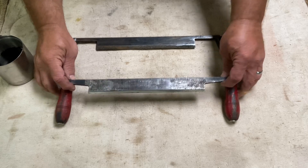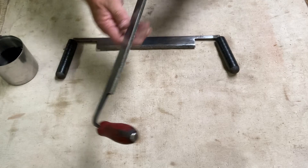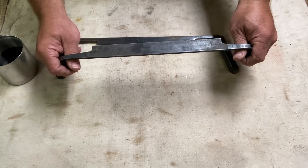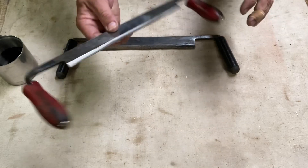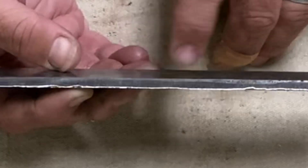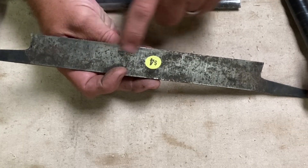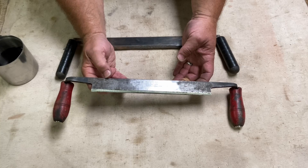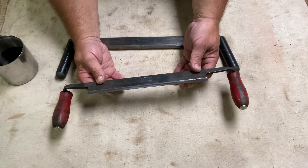So I'll bring you down here on the workbench and we'll take a closer look. As you can see, these handles here are rather offset, which I think helps when you're using the knife — it gives you a little bit more stability or control. I went ahead and put it on the grinder just to see what the grind was. Both of these are ground very, very poorly. Thankfully, not too much has been ground on the backside, so I want to clean this one up really well and get it sharpened nicely. I think we'll have a good tool.